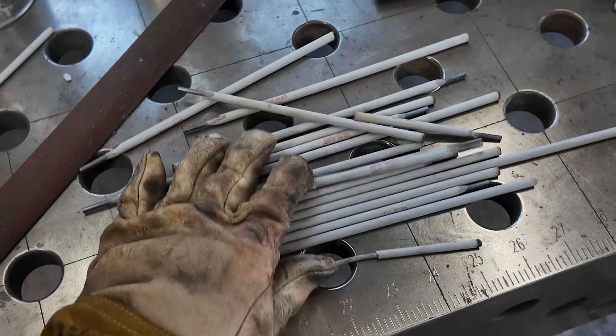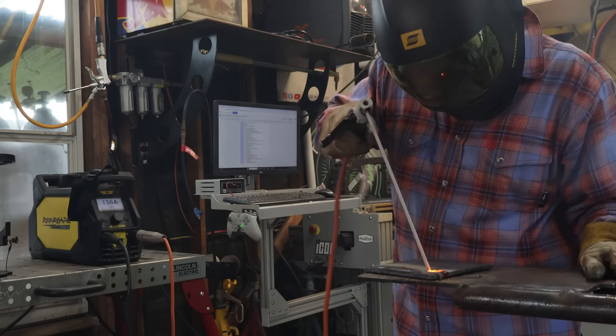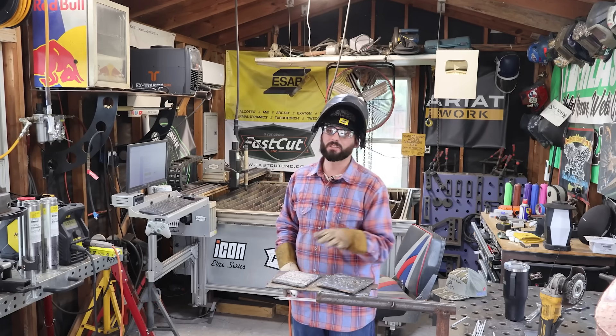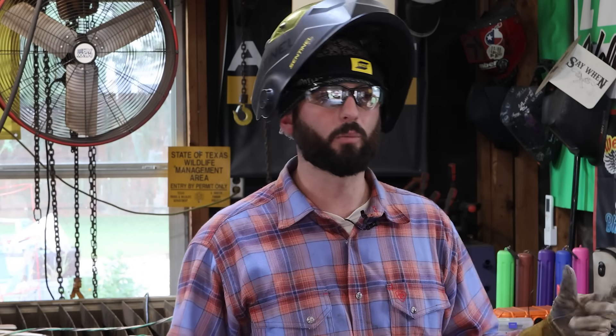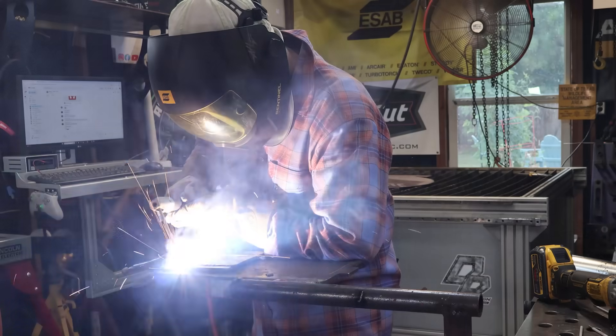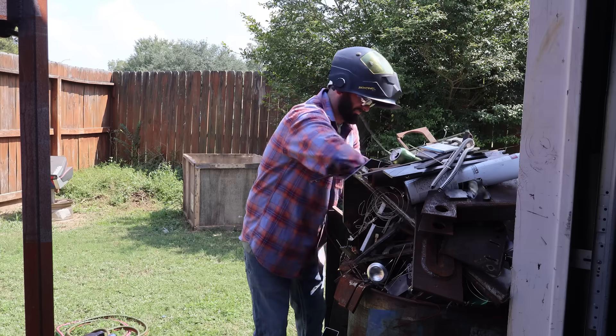A good way to trigger your welding instructor is to grab a handful of unfinished rods and say hey, what do I do with these? When you need to stop, stop — that's for while you're beginning. I want you to not get frustrated when you get stuck and snap that rod off; rather, compose yourself, snap the rod off gently, set it aside, get a new rod and keep going. But once you start getting down the process, you need to start using those old rods — if you're welding and get down to a little bit, start the next bead and make a tie-in. I've seen students want to weld all the way across the plate and end up welding too quickly. In stick welding, we don't have that luxury — you have to learn how to make tie-ins, and that's where a pile of scrap rods comes in.